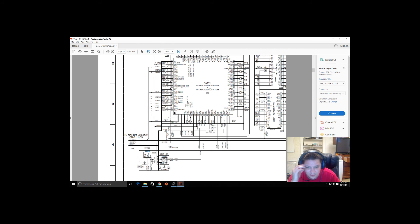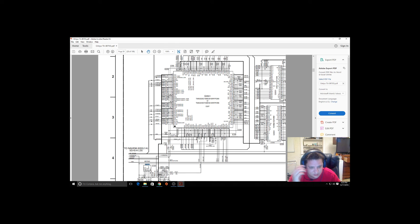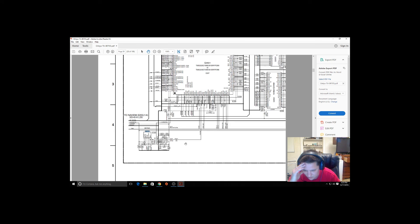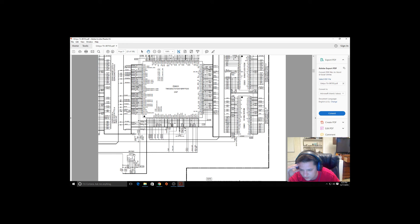As far as I can tell, Q3501 here is powered on because it does get just slightly warm. The RAM doesn't really get warm at all. But why is Q3772 getting hot? That's my question. The other one — Q3373 for this DSP chip — it doesn't get hot, and that chip is just slightly warm like the other one.